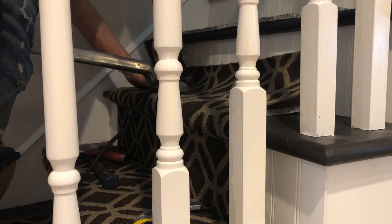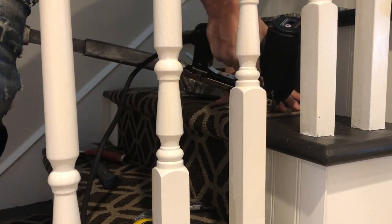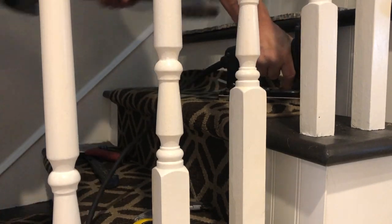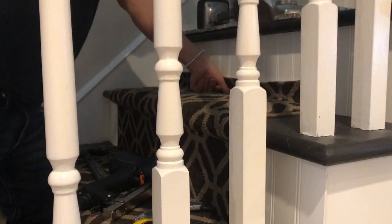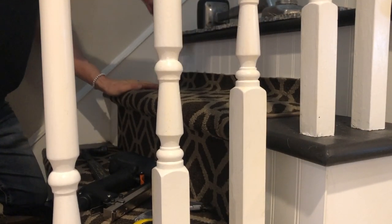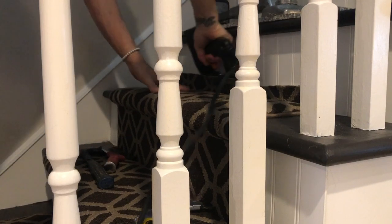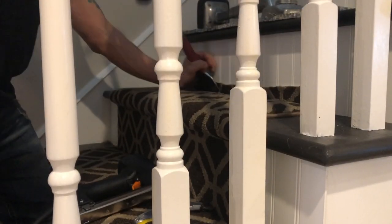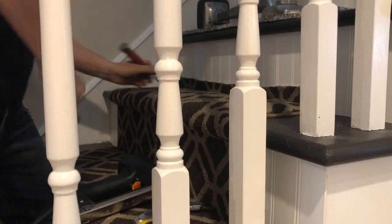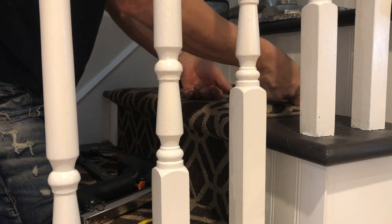I put a lot of pressure on that kicker. I don't kick it. I just lean into it. Get those staples in the sides. And then score that with my tucker. Because it's so rigid, I've got to bang it down. Get some staples back there behind the smooth edge, between the smooth edge and the riser. Get a nice V groove before I cut it. Score it. And now, nice sharp blade. I'm going to cut it from end to end.